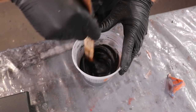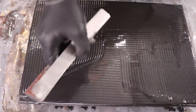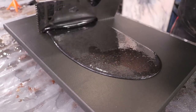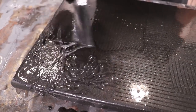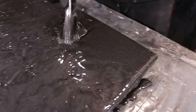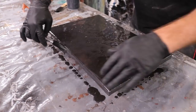That is cool - looks like liquid metal. We're going to pour our epoxy out. We're going to trowel it with a 1/8 by 1/8 square notch trowel. We're going to chop that with our brush to remove those trowel marks, and then we're going to torch those bubbles out. I'm going to remove any loose bristles from my brush and start where I left a little bit of epoxy higher on my piece so it primes my brush but still leaves enough epoxy to level out. I really like the design that chopping with the brush creates - it gives a really organic look as opposed to the lines from the trowel. Pro tip: do your edges last after you chop the surface. You're going to push epoxy over those edges in an uneven fashion, and coming back with a brush in long horizontal strokes makes your edges appear nice and smooth.